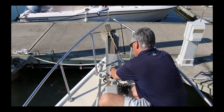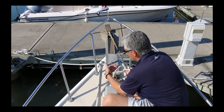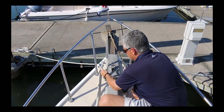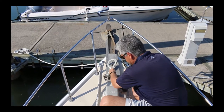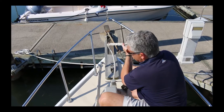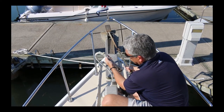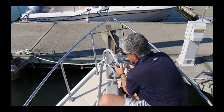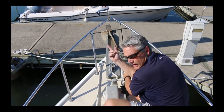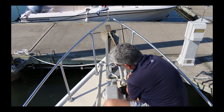Reverse procedure when you bring the anchor up. This sometimes needs a little bit of assistance — you'll motor the boat up, start giving the hand signal to bring the anchor up, and they'll be operating the windlass in the back. Sometimes it's just not pulling so you've got to futz with it a little bit. The most important thing when you're raising it is to leave about a foot of line out. If this splice gets back into the windlass, it's very difficult to get out. It'll be your responsibility up here in the bow to make sure as you're winding up that you leave at least a foot of the line out.